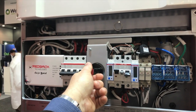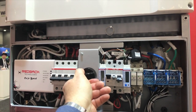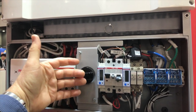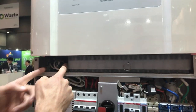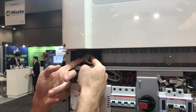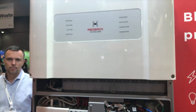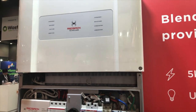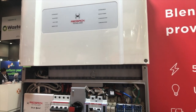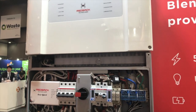It has to be in the off position. The on position would lock it in. So we turn it to the off position, we can take the cover off, pull out the safety pin, disconnect the comms cables, and then push the inverter up and move it. For replacement of the power module, you've got full isolation of DC, and you can isolate the AC as you would normally do. It makes for a very sweet install.